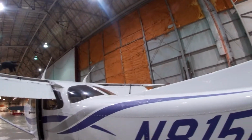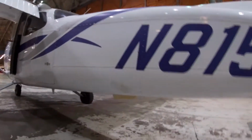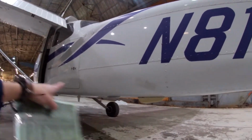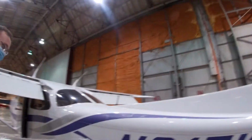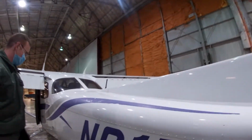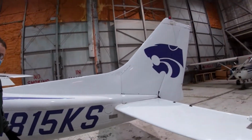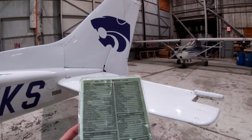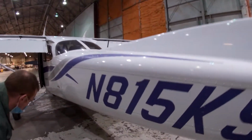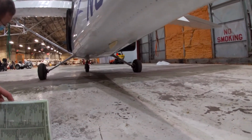Check with the antennas, make sure they're all good, as well as down here. Both of these, right? Yep. Left skin. So basically, it's the body. Check and make sure it looks good. No loose bolts. Nothing out of the ordinary. Bottom of aircraft. Make sure it looks good.